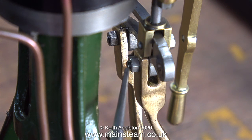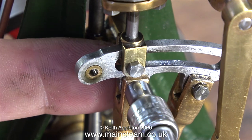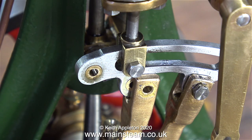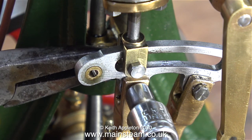The pins that hold the expansion link in position on the valve forks are too long, so I'm going to have to shorten them. These nuts at the back are only lock nuts because the valve forks are threaded. This was a very simple job — I removed one of the pins, introduced it to the 1-inch belt sander to grind a little bit off the other end, and then refitted it.